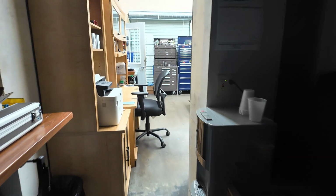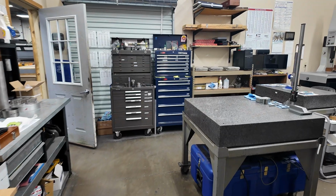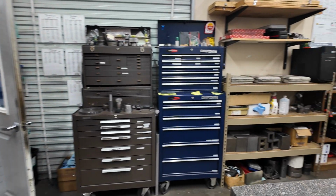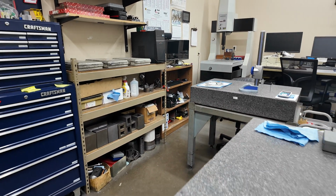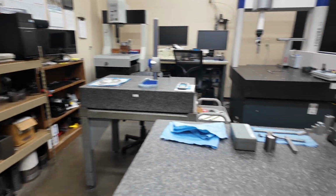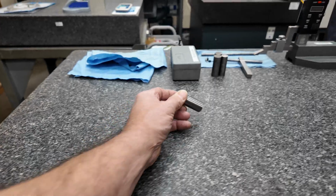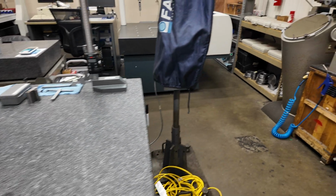When I mean calibrate, you know, the ISO 9000, whatever number they're on right now, basically there's a routine to check your micrometers, to calibrate them like once a year or every 6 months. Or if you're doing high production, that period may be more frequent depending on what you're using, like pin gauges. If you're using them on the floor as a pin gauge to test a hole, and you're doing thousands of parts, you may want to have a higher frequency.